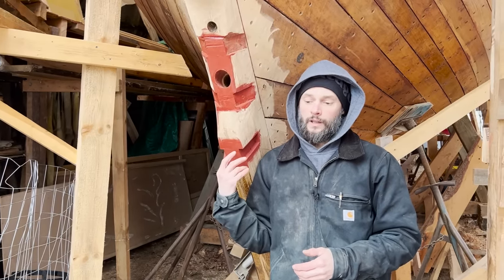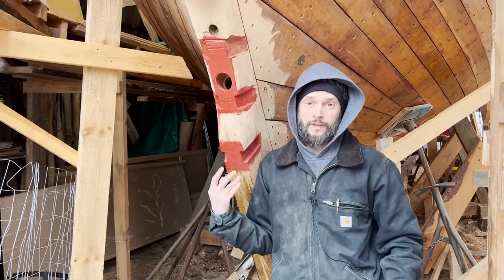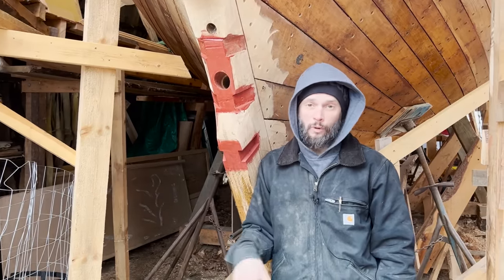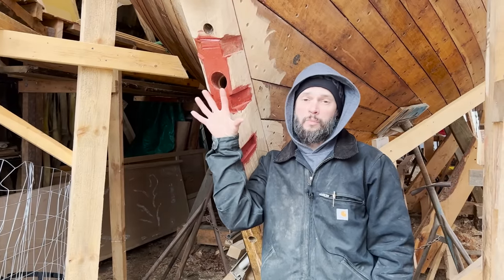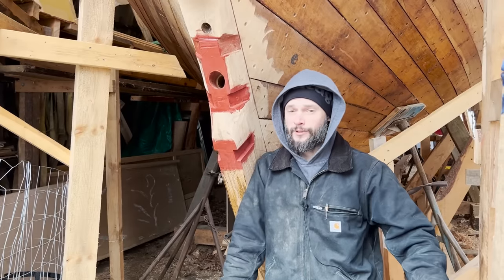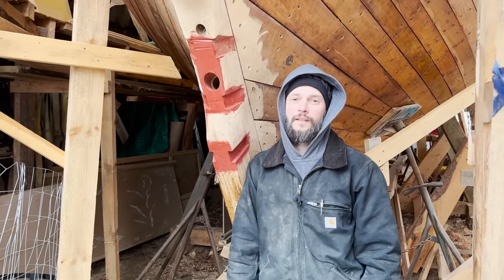So for Arabella, a 50 horsepower motor is plenty powerful. Boats this size have 30 horsepower motors in them, and they're diesels, so they're slower and they're high torque, and they're pushing a fairly small prop because we're only going to try to get the boat up to 7 or 8 knots, absolute max. Probably going to be motoring it more like 3 or 4 or 5 knots.